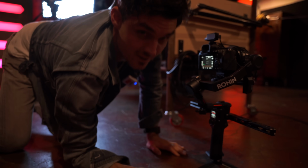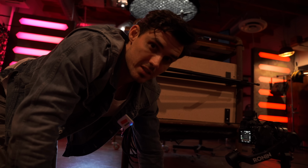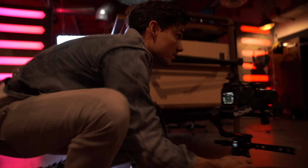It's saying it's 0.7 meters away. It's not getting any bounce. It's interesting, so this stuff doesn't work on all materials. Black materials, particularly paper, or in this case, black foam, it's not going to bounce it back at all. And this is where it gets super nerdy. Near infrared operates under a different set of conditions than normal autofocus systems.